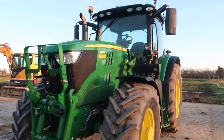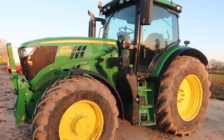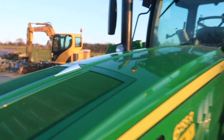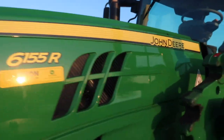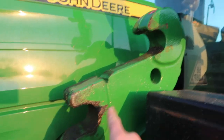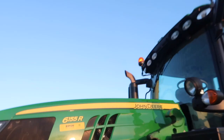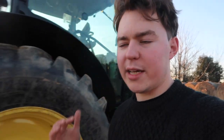So here she is — I'm just going to take her into the yard because I've got to clean the rest of the windscreen and also polish the bonnet, which was a job I was going to do. Having the front loader in the way makes it quite difficult to clean and polish the bonnet because it's been getting pretty mucky up there. Something else I did was I just put a bit of grease in these brackets here for when the loader goes on and off — I've noticed it really does help in just sliding the loader on when you reconnect it. It lets the loader slide onto the brackets a lot easier.